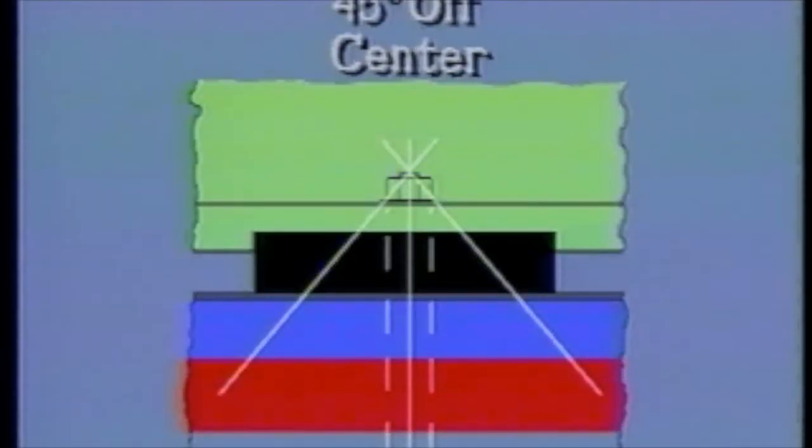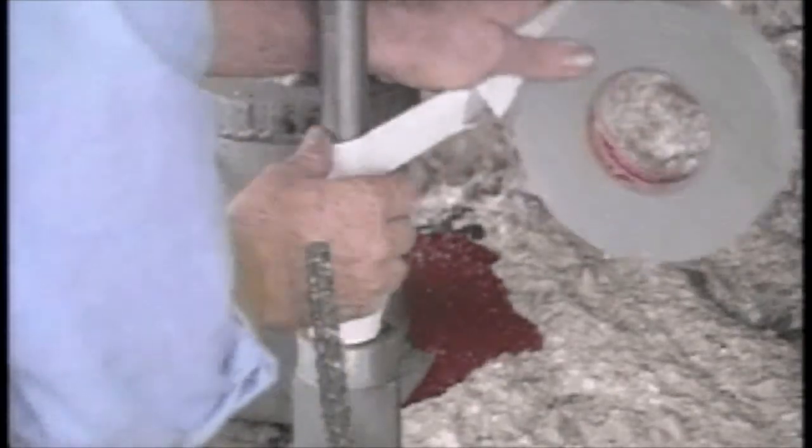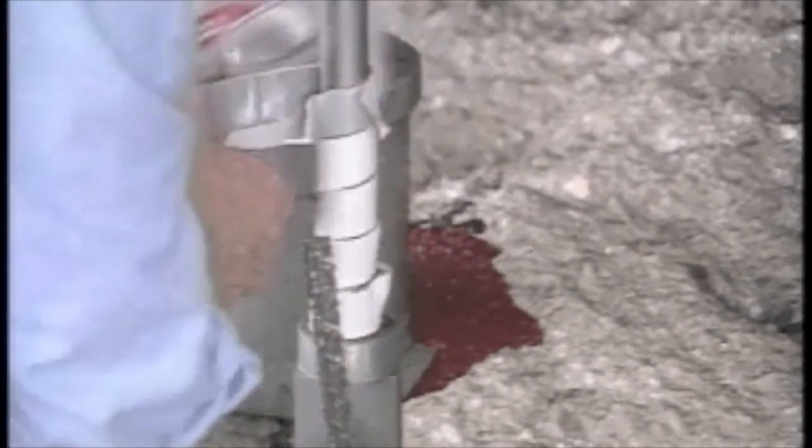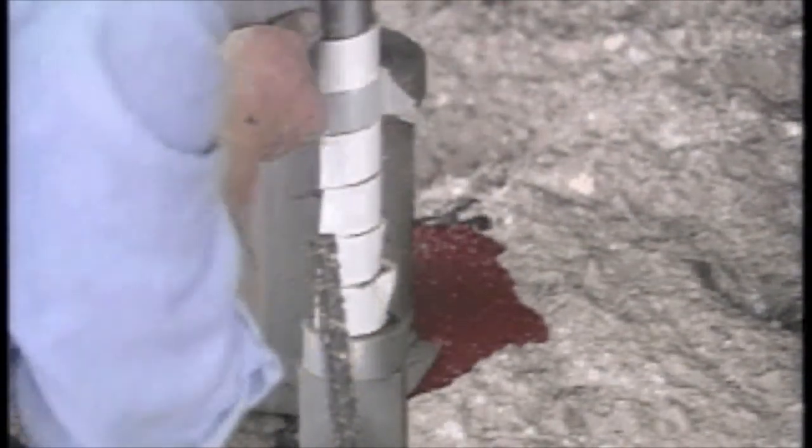This is important because epoxy chocks are loaded essentially on a 45-degree angle off the center of the bolt. It is obvious that the thicker the isolation material, the less load-bearing area on the chocks, thus the less area available for effectively holding down the machine and maintaining permanent precise alignment.